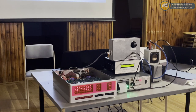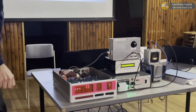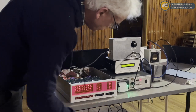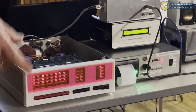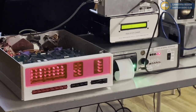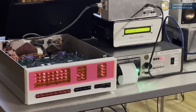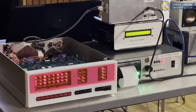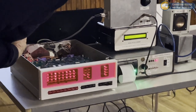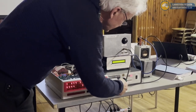Is it pre-computing or is it doing it on the fly? It's doing it on the fly. So it's printing out the sum of sequential numbers. You notice it's slowing down, because I've used the very slow way of doing the mathematics, simply because it's the only way I could easily implement the 16-bit maths in the space I had available. But it does work. It's printing out the value in hexadecimal, which is probably not that helpful.